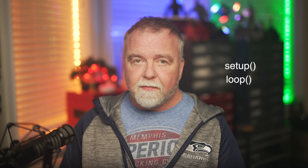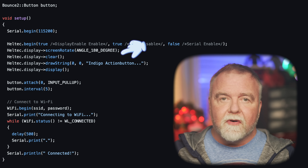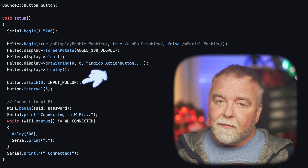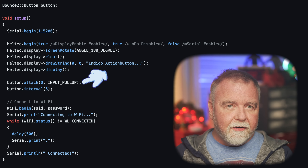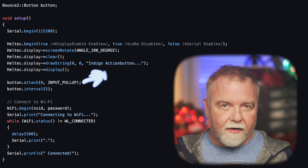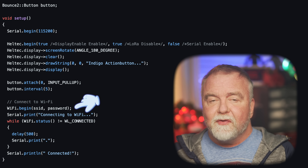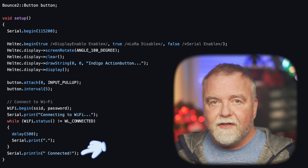Every Arduino-based project — ESP32 or otherwise — has two important functions you must provide. The first is called Setup, which is called one time when the chip starts up to do your one-time initialization. Then it calls the Loop function you provide, repeatedly and forever, and that's where you do your ongoing work. Looking at the setup code: it initializes the serial port for logging, clears the Heltec OLED screen, sets the rotation, and draws some status text. Next, there's a Button class object — predictably called Button — which handles debouncing. That's important with a relay, because even though the relay is slammed shut by a magnet internally, it might still bounce and close several times instead of just once. The class uses interrupts and a timer to sort that out. Next we connect to WiFi, and we loop until we're successful because there's nothing this program can accomplish without a connection, so we might as well wait. Once we have WiFi, we return out of setup and the loop code runs.